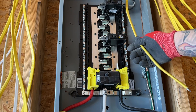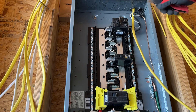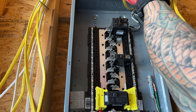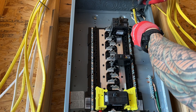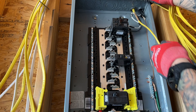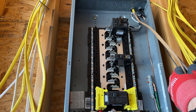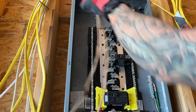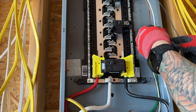Now that we have our wire secured, we're going to go ahead and wire in our breaker. You will strip back this casing with just a light little score on both sides. You can pull on it and strip it — get rid of this paper wrap. Then we're going to separate our black, our ground, and our white.